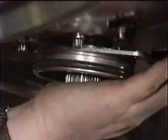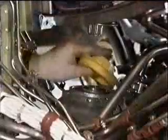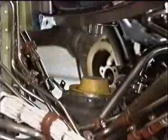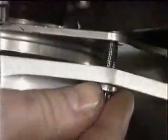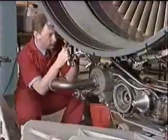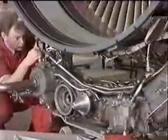If the tower shaft is pulled down with the gearbox, disconnect it and push it back up into the intermediate module. Fit the protector on the top of the angle gearbox and fit the tower shaft retainer to the bottom of the tower shaft tube. Carefully pull the gearbox forward, making sure that no fouls occur.